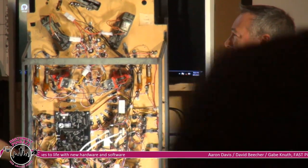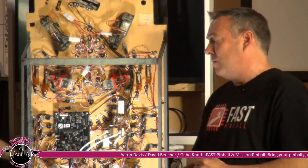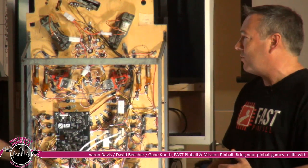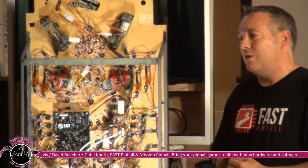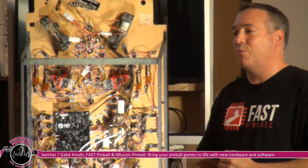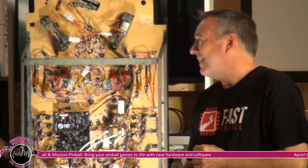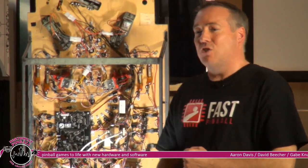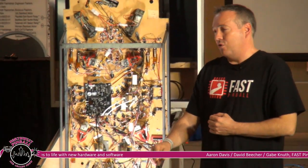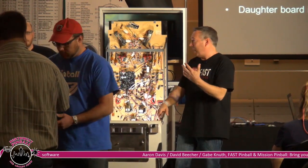We needed to figure out how toys integrate, because a toy is not necessarily a switch or a driver — it's something different. We came up with the concept of 'extra data' — extra data in and extra data out. Extra data in would be something like an accelerometer sending X/Y coordinates. For the servo board, it has six drivers, so it needs six bytes of data — one byte per servo, so byte zero automatically becomes servo zero, and so on. You simply indicate how many ins and outs you need.